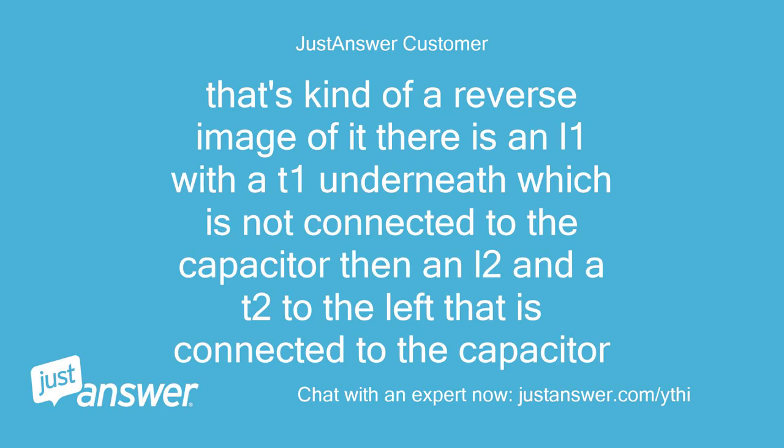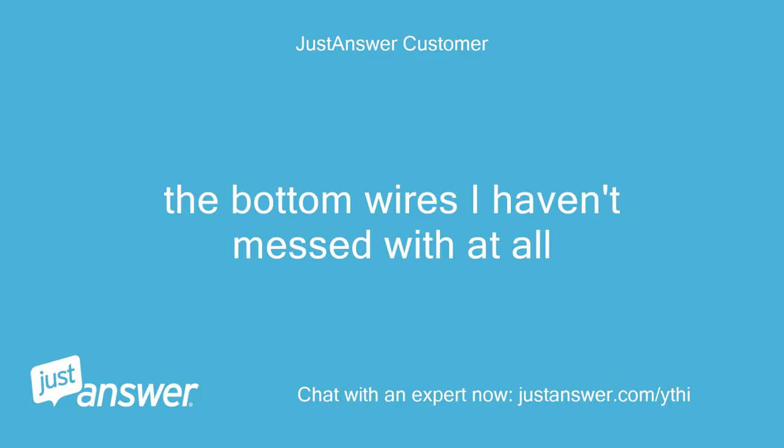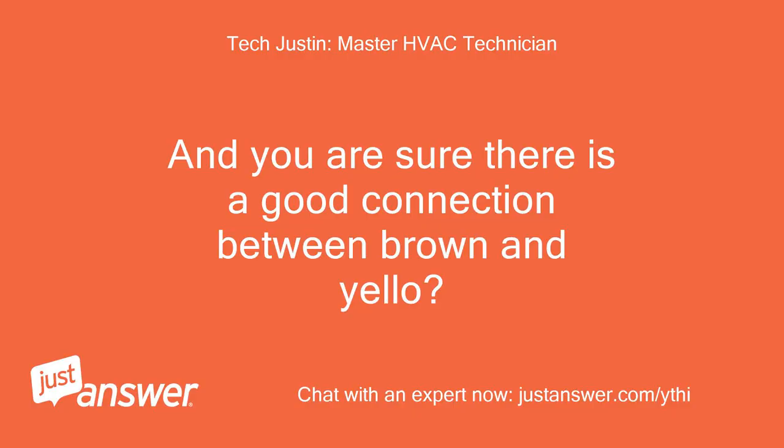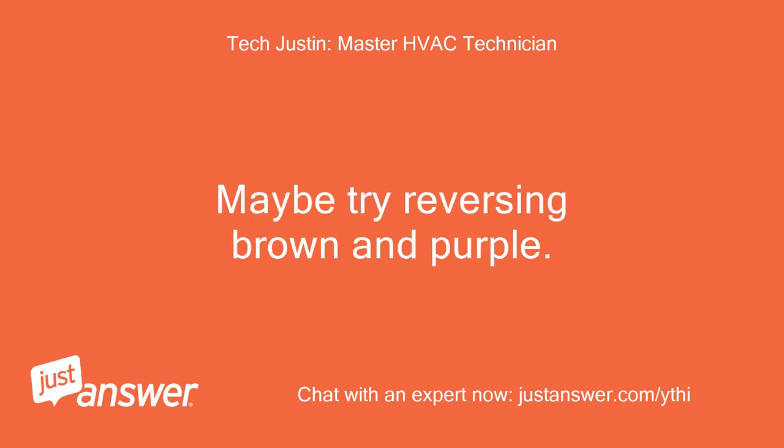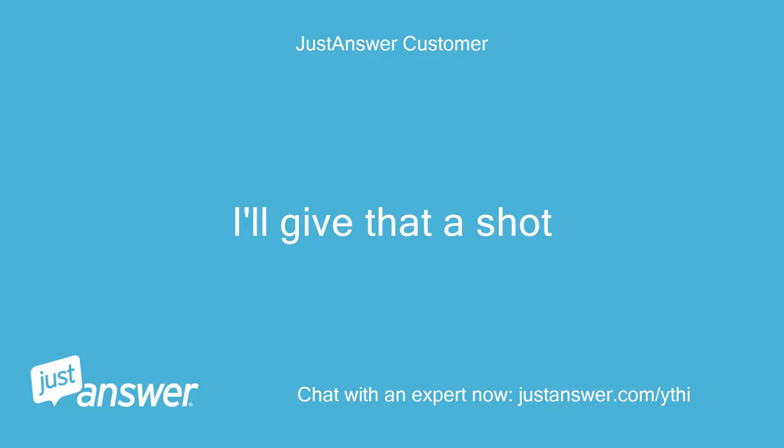That's kind of a reverse image of it. There is an L1 with a T1 underneath which is not connected to the capacitor, then an L2 and a T2 to the left that is connected to the capacitor. Yes. Okay. The bottom wires I haven't messed with at all. And you are sure there is a good connection between brown and yellow? Maybe try reversing brown and purple. Put purple to yellow and brown to the fan terminal of the capacitor. I'll give that a shot.